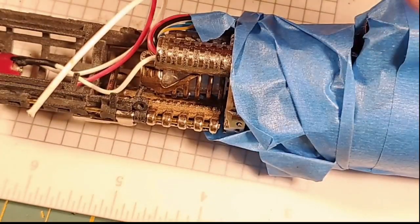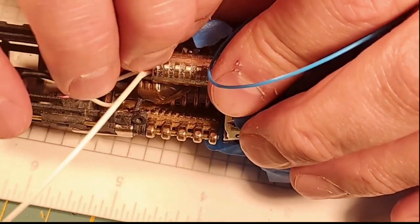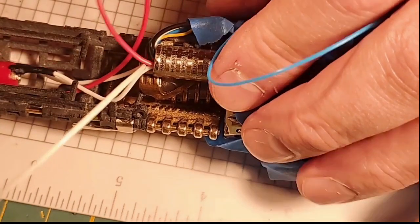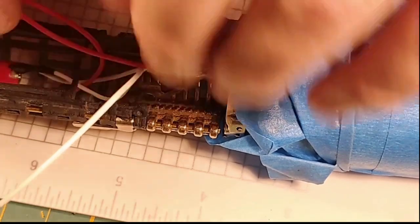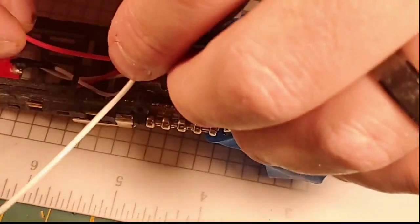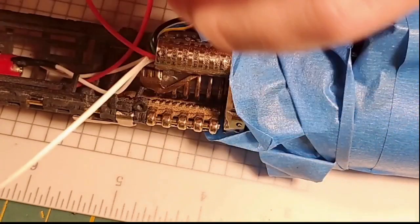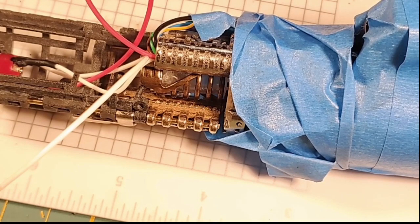So next, what we have to do to solidify this battery connection is we're going to bring our positive line out of our tape. And this will be good because we'll have all of our positives out of the way. So basically what I'm going to do, just so y'all know, is I'm going to merge these positive wires, but while I'm merging them, I'm also going to add 2 strands of 30 gauge wire that are going to feed our Neopixel accent positive.